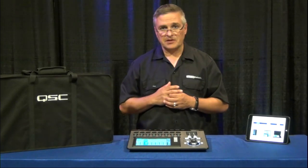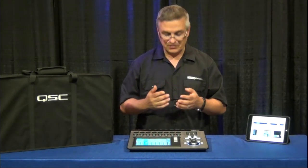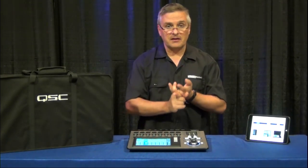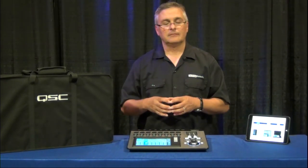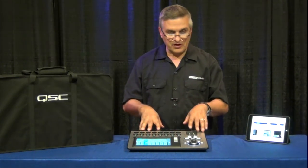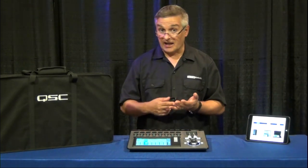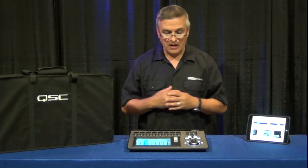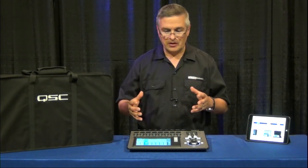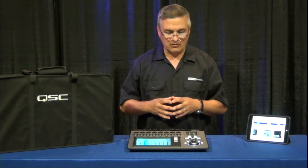One of the other benefits of this mixer is a very large amount of DSP built into it. You have four effects processors. Every one of your channels has a full four-band EQ with a high pass, high shelf, and low shelving. On each of the outputs, you also have 28 bands of graphic EQ on all six of your auxes on the back, as well as your stereo auxes and your main out. You also have delay and some other filtering, plus feedback rejection built in. So there's a lot of DSP built into the mixer. I'm going to dig a little bit deeper and show you some of the interface features and just how easy and clever this is to use.